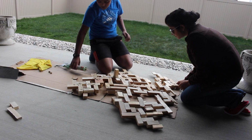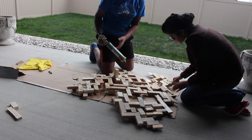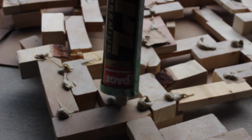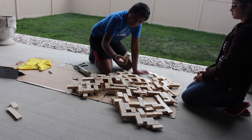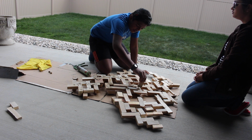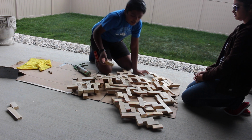The technique I'm gonna use is some PL Premium, which is a super strong adhesive, not sponsored by the way. And I'm just gonna do some dollops. Dollop. Dollop. Dollop. I don't want it to be bumpy on the wall, so I'm just gonna take a scrap piece of wood and push it into the gaps a bit more and flatten it out, so that it won't be bumpy against drywall or whatever wall you're gonna hang it on.